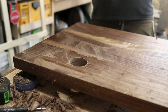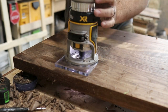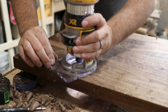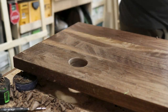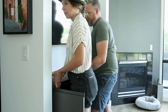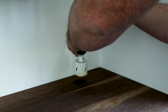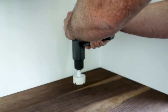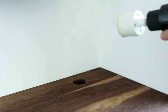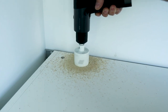This went okay, but I think the reason it went well was because I took the extra time to lay down green tape and make sure I was as careful as possible while marking out where the hole was. This also became the template for where the holes would be when we drilled out the holes in the back of the cabinet. I marked my holes, moved the countertop out of the way, and finished drilling through the back of the cabinet.